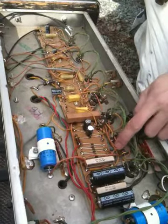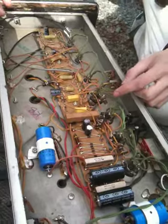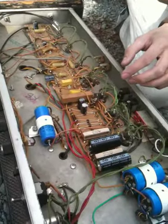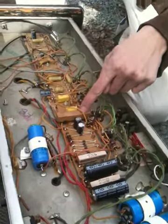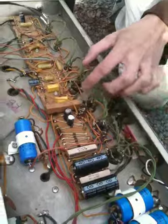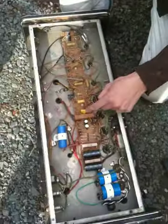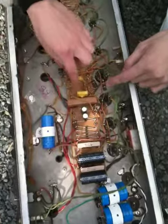Do you think it could have been shoddy workmanship from a previous repair? No, everything looked totally fine. But it's weird. This is usually four different resistors in parallel, splitting up all that heat amongst four. Except now everything goes through one, and then these two outside ones get a little screen grid resistor.